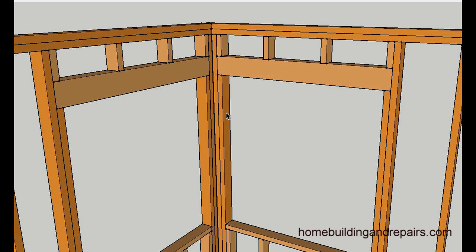The most common reason for using this type of construction method would be if you had window trim. For example, if you were going to use wood windows and then put a two inch piece of trim around the window to give it a picture frame look, then you would need to use something like this. You can't stick the windows all the way in the corner — you're going to need some room. And you might even need to move it an inch and a half further, depending upon the thickness of the window trim.